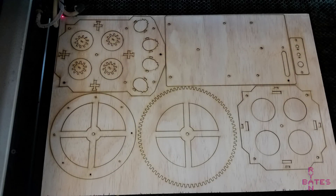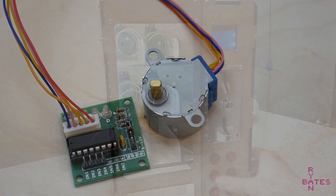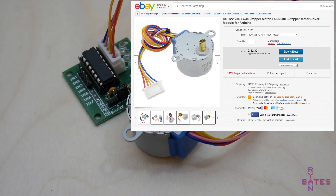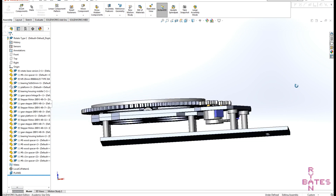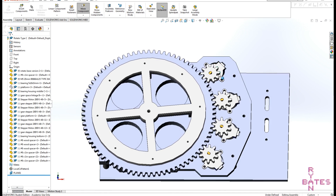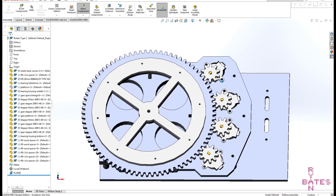Version 2 is a unique example. Many years ago I bought 4 of these appliance stepper motors thinking they would be a good solution for my Vanduino, but they were not. This is the 28BYJ-48 variety seen in many Arduino kits. These steppers are geared down 64 to 1 which is great for this application. They are extremely weak, but if we stick 4 of them in unison we can mitigate that issue. I've also geared down the driving gear from 12 teeth to 10 teeth against the previous iteration of this design.